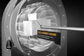The next step is what puts all BSA air gun barrels in a league ahead of the competition. During an optimized process we call cold hammer forging, the workpiece is hammered down under immense pressure to forge the rifle thread into the pristine inner surface of the workpiece.